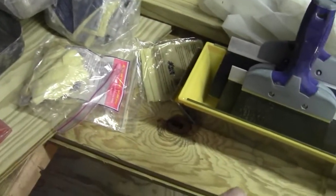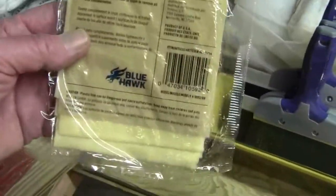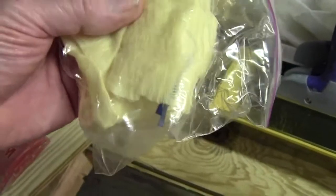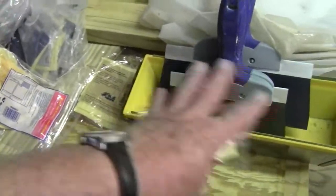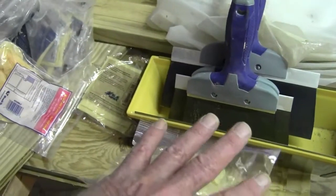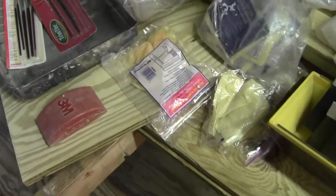When you paint any surface — sheetrock or wood — sand down all the edges and use tack cloths. They're an oil-impregnated cloth and they will lift the dust. We save them and put them in little baggies because they're oily. You can rub them all over a drywall surface that you've prepared and are getting ready to prime — it applies to sheetrock as well. I always have a bunch of them because it is very important to get the dust off.